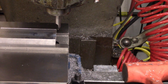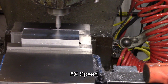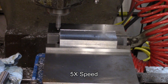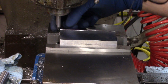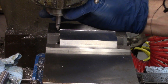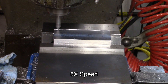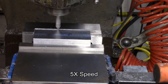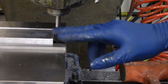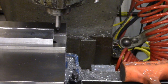I'm going to bump up the speed to 1750 RPM and see how it cuts with that. I don't really see much of a difference — you can see how the tip's looking. Shouldn't be bad, it's just aluminum, yeah it looks nice and pointy, I think we're doing just fine. I'm going to try bumping it up to 2720. I'm going to keep this speed and feed, it seems to be working. I'll skip ahead through the magic of television to the very last line so you guys can see that.